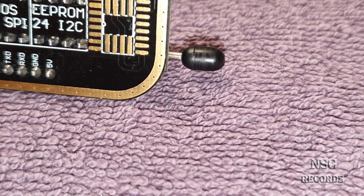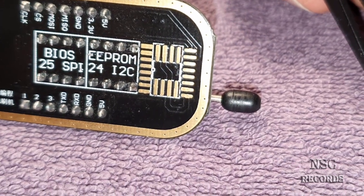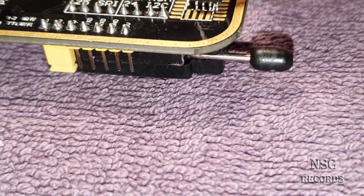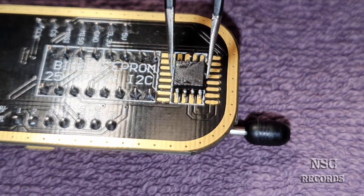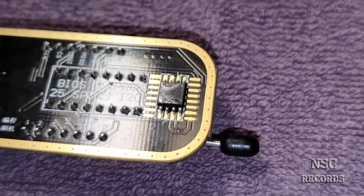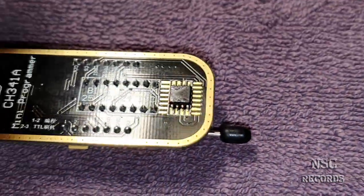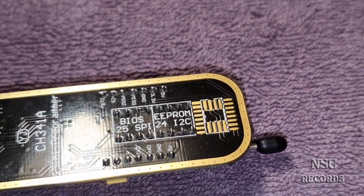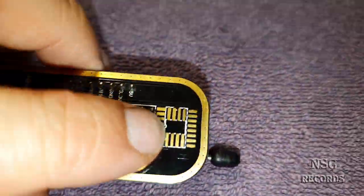The symbol is on one side — check that yourself. Please always have patience. This is the way you can also solder it directly on the BIOS programmer itself, but I can't recommend it because over time you're going to destroy those pads too. That's why it's better to just get a clamp — I'll show you that on the internet in a moment. It's better not to solder directly on the programmer.